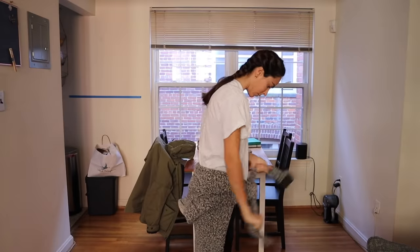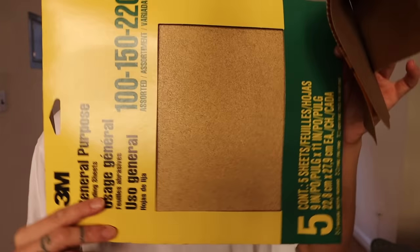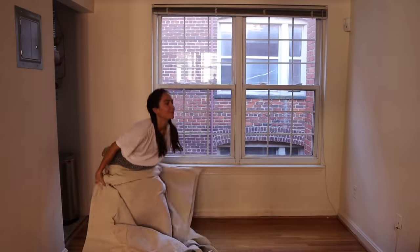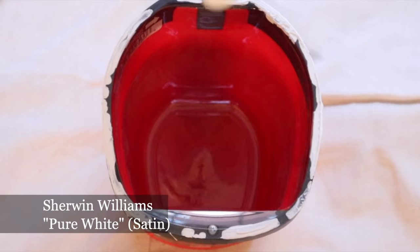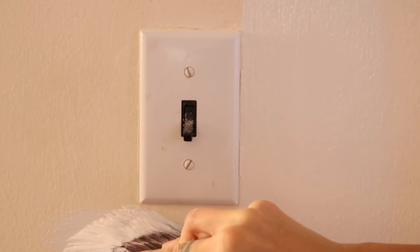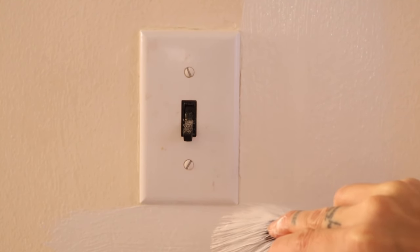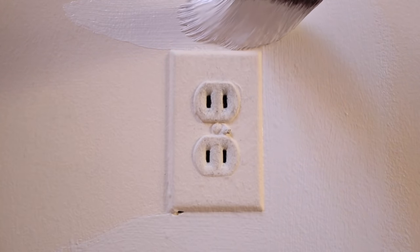For any project, I try to set aside a whole day to prep and paint. It always ends up taking longer than I think, and you don't want to get stressed and have a meltdown, which I always do. I sanded everything down with sandpaper to give the paint a smooth canvas. Make sure to wipe down the walls with a wet rag and get rid of any dust and debris. As far as painting, Lean has limitations with what she can do with her rental, so we'll just be painting white. Here's my salacious painting tip: make sure your brush is saturated with paint, then do a kind of press-and-twist motion so that you have total control over where the paint goes. I learned this from watching hours of wall-painting tutorials on YouTube, which is very cool of me and I won't be apologizing for it.